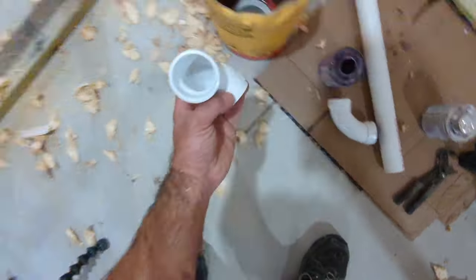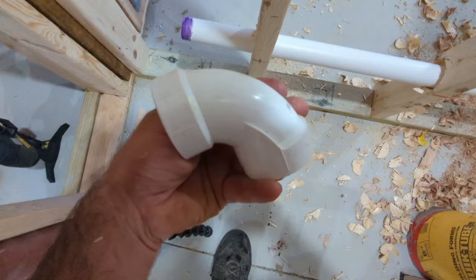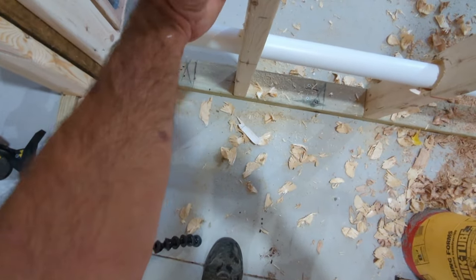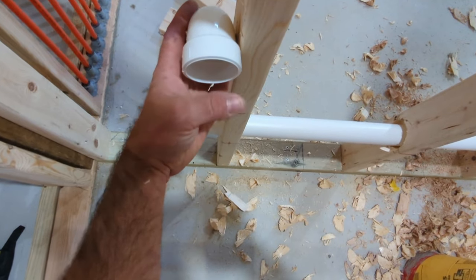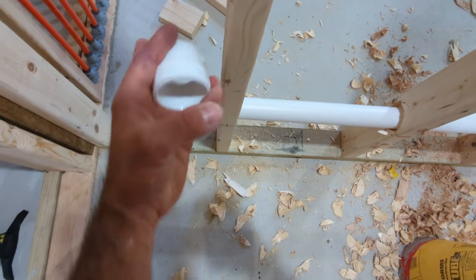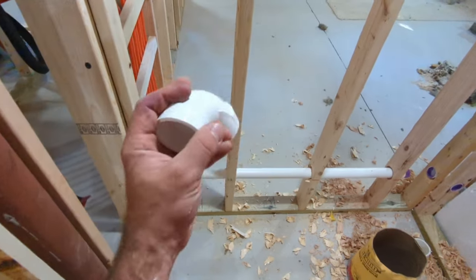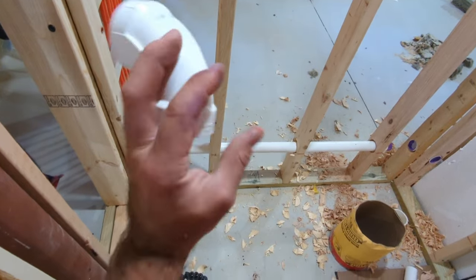When I roll out of the wall, sometimes I like to see the short radius, because we're not fighting the shortness of the radius when we fall right off and down into a vertical, and it keeps the protrusion of the adapter and everything back close to the drywall, so your box flange actually covers it up. A lot of times if you use a long radius elbow to roll out of the wall and then add the adapter nut to it, and you get all done with the trap and put a box flange on and try to snug it up to the wall to clean the whole look up, especially when you have a pedestal sink, it doesn't make it to the wall and it looks bad.